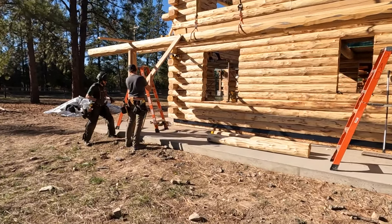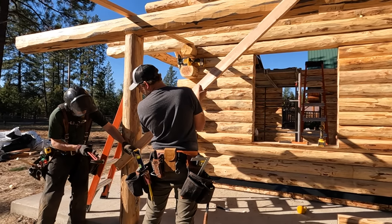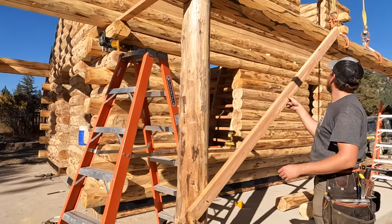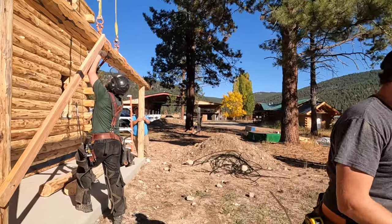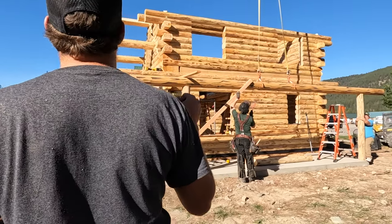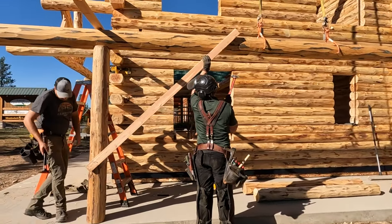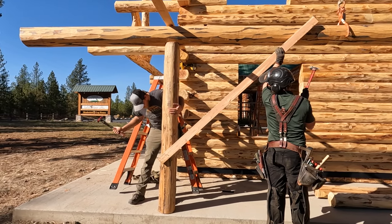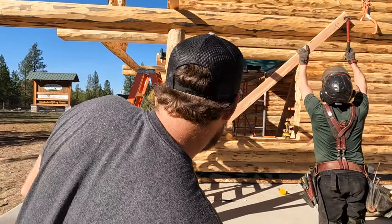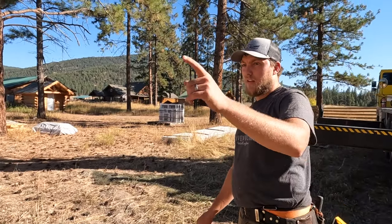Let's put a cross brace like this. Do you even nail, bro? Here, Isaac, hold this, I need to go sight it. So this one here, we want to make sure that we're right on before we nail that. Okay, we've got to go towards you. Can you pull the top that way, like tilt it? Right there, stop. Now hang on, Isaac, I've got to tap this over as well. I wish there was an easier way to do these. Okay, sight that. You usually sight this with the corners, just eyeball it straight and nail it. Okay, now we're good left to right, at least on this end.